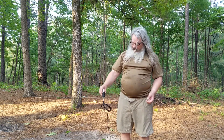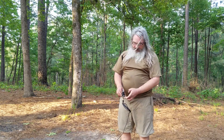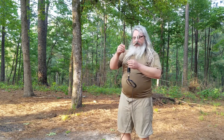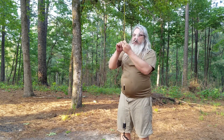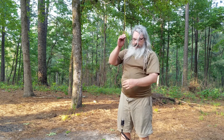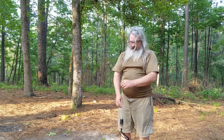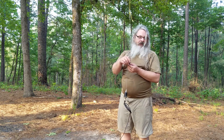What this is is a Tram brand antenna made for an NMO mount that has had the elements replaced with steel cable. It's the exact same diameter as the original elements. At the top it has had a little ring thing clamped on the end, and the lengths are cut so that they are the exact same length from tip down to the end as the element. The diameter has to be the same diameter that goes into the holes in the trap and into the base.